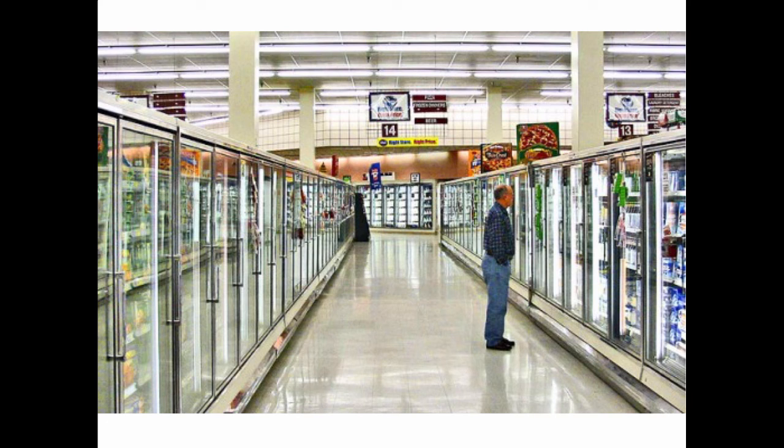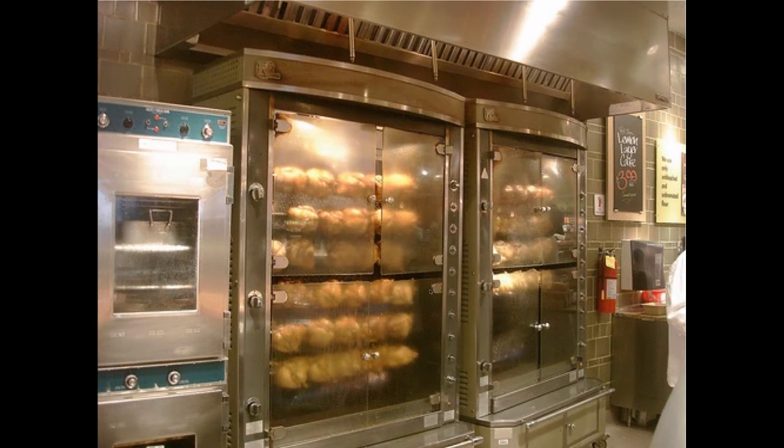So you could be in a space that's being heated with a furnace that's throwing warm air at you, but the convection currents of the warm air moving across you will make you feel uncomfortable. And the cold surfaces, because air is a lousy medium to heat, say, cold glass, the cold surfaces will make you feel uncomfortable. But if you can heat the floors with radiant heat, you'll feel more comfortable.